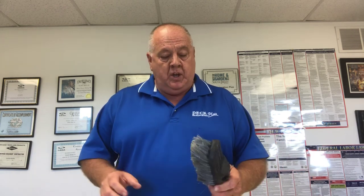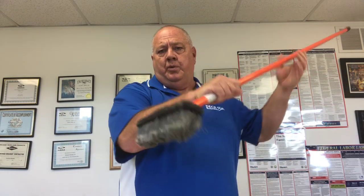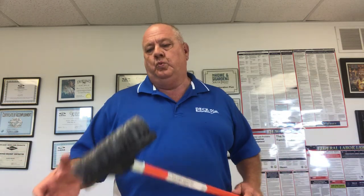We're always looking for other soft bristle brushes. I knew somebody — Sam Williams with the Forest Products Lab — who used to mop his deck: just make a sealer and mop it on. It's really just a matter of how you're going to apply these products easily. Truck washing brushes with soft bristles are another option — they achieve the same thing and you can get those most anywhere. Put them on a pole and it's just dip and brush, dip and brush.